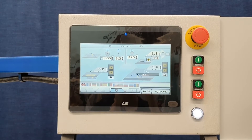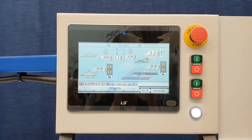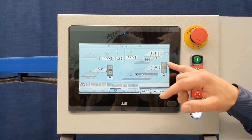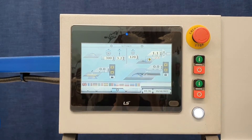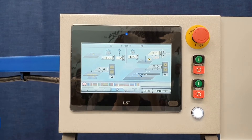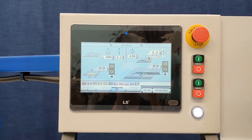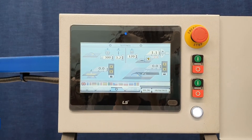From there we also have the diameter thickness of your scriber. There are different sized scribers, and if you're using a different one it's pretty straightforward — this will automatically adjust the parameter. What this parameter does is tell the panel saw how far to raise the scriber automatically to cut into your panel. At the moment it's set to 1.1mm.